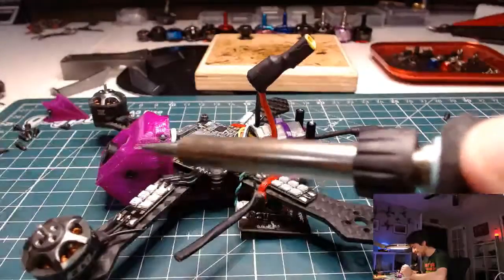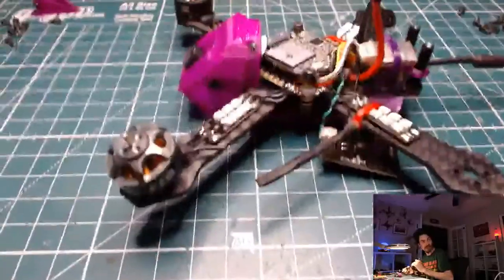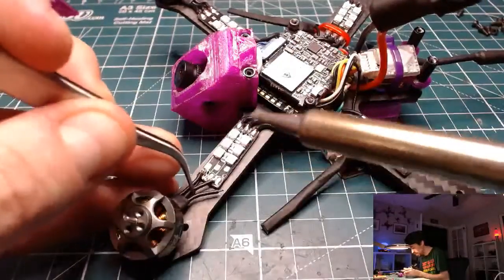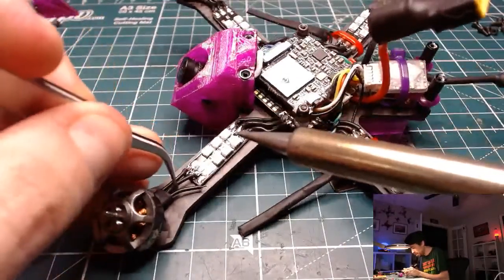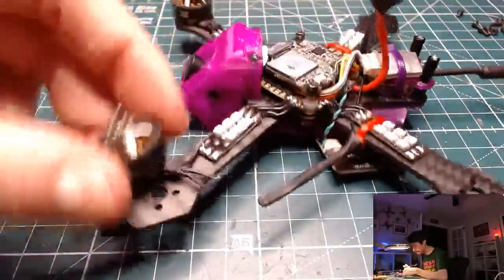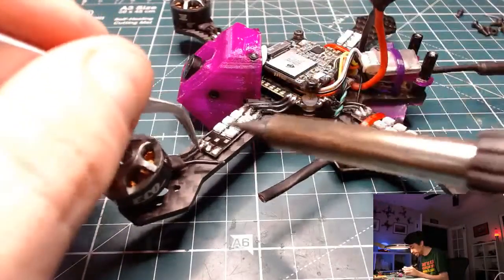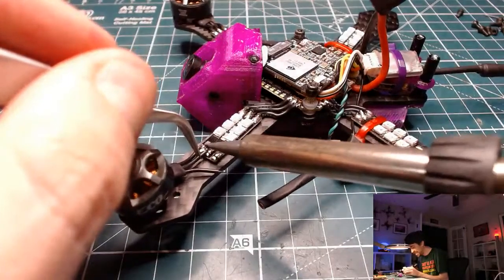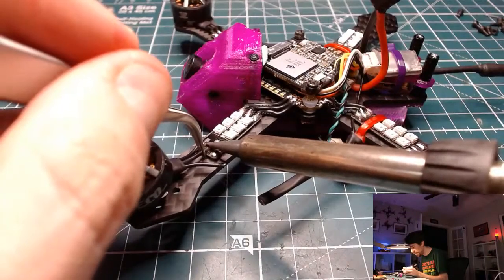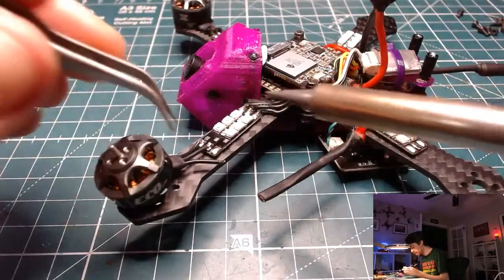It would be cool if I could set the threshold of temperature drop. That's what I would need to do, lower the threshold on temperature drop to a couple degrees, because I don't think it goes down at all when you jam it into the kabuki, into the steel wool filled guys. But it must drop a couple degrees when you're actually soldering and the heat is being sucked away into the PCB.